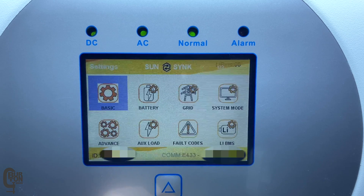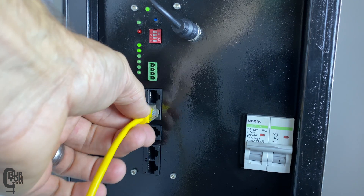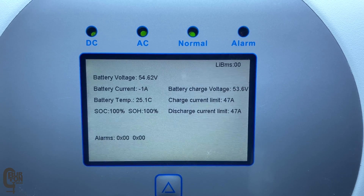If you don't see this screen, you may be seeing a screen with a whole lot of numbers where everything is zeros. This means the communication is not working correctly. If this happens, you may have forgotten to plug the comms cable in, or it's possibly a fault with your comms cable or Ethernet cable. Maybe the CAN high and low is on the incorrect pinout, or maybe some of the settings are incorrect. Either way, let us know in the comments how this turned out for you.